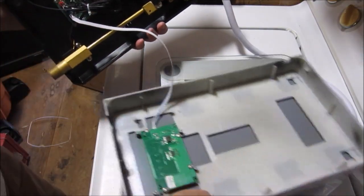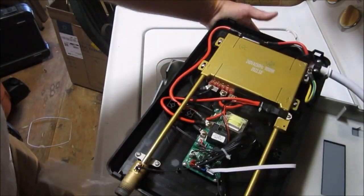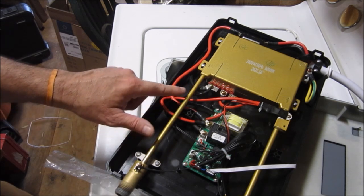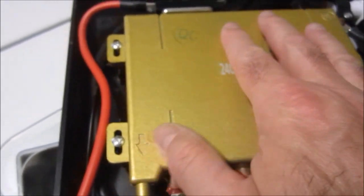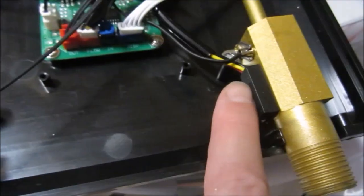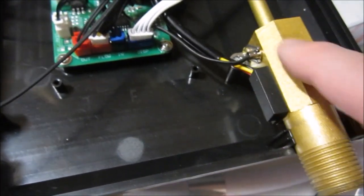Wow. Doesn't seem like there's a lot in there, but I'm pretty sure there is. Let's get in close. So inside, we've got this new kind of rectangular kettle that has two very, very long stems on it. One for the cold side that comes in and hits some sort of sensor. I don't know what that is, but I'm guessing this is a temperature sensor. This is probably some sort of flow meter that is on the cold supply line.